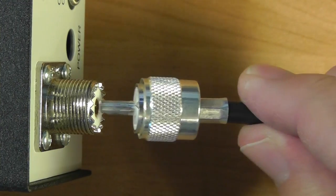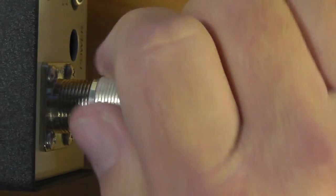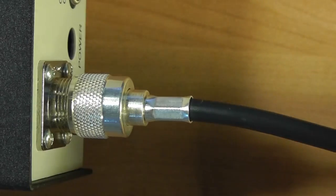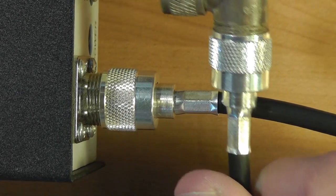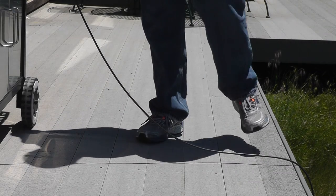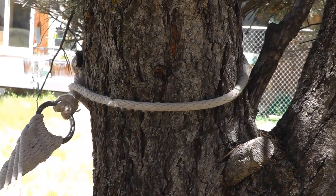We connect the coax to the radio by inserting it so that the little flanges match and then screwing on the outer connector. It should be only finger tight. And when you route the coax, try to avoid sharp bends. There are elbow adapters if you need to push your rig right up against the wall. Outside, coax should be up and away from anyone and anything. It should not be a tripping hazard. It should not act as a guillotine. Don't let moving tree limbs chafe it.